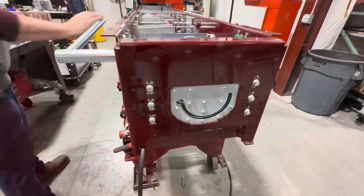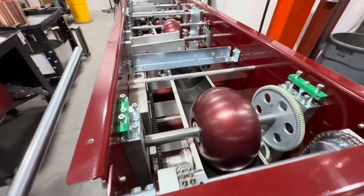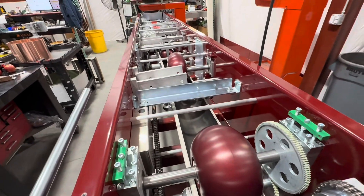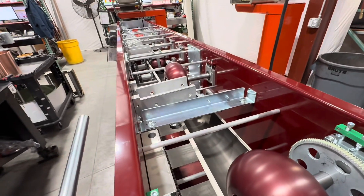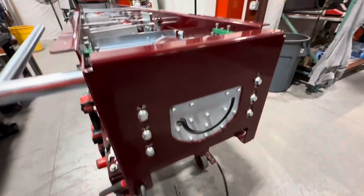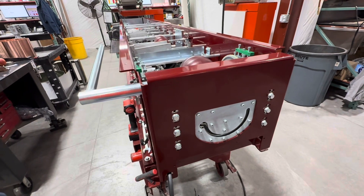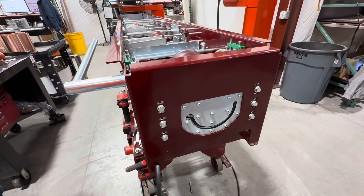Let's get going — we're going to look at a half-round machine. For maintenance, there's really no maintenance other than oiling the guillotine blade every day. You can use WD-40, but don't spray it past the blade onto the last drive — it will create slipping issues.